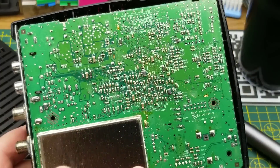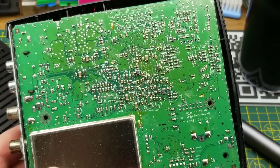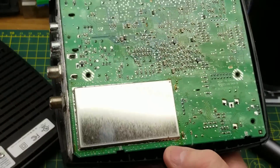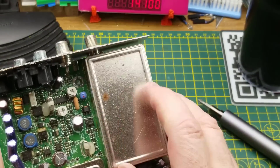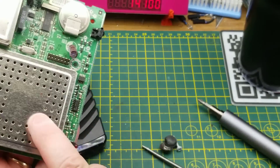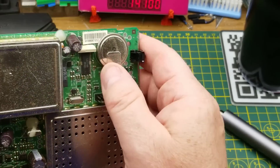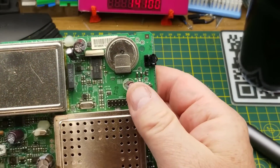Let's see what we've got here. There are an infinite number of bypass capacitors on this side - wow, that is a lot. Down here we have an RF can on what looks like the output side. That's probably the modulator for the output, and then there's tuning, and more shielded RF stuff. There's also a little memory backup battery.